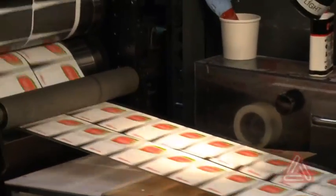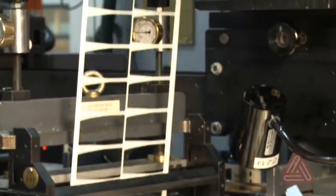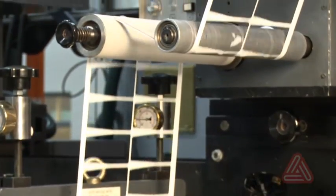Your press should be in good working condition and capable of converting films. Nip rollers should be functioning so that web tension is properly controlled, and the entire web path should be examined for frozen idler rollers or ink and adhesive build-up. If you're currently webbed through a turn bar, consider bypassing it until you've had more experience converting with this liner.